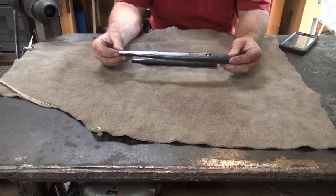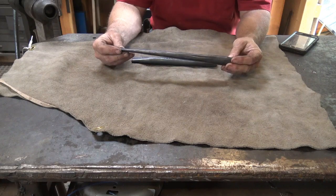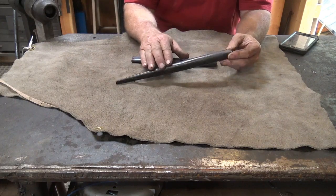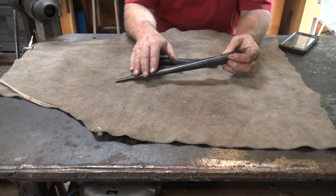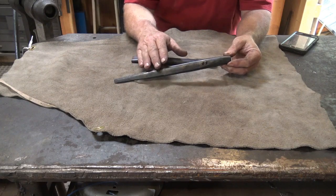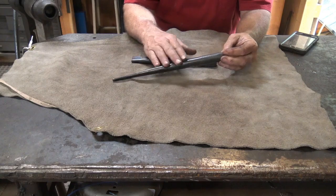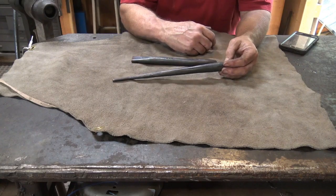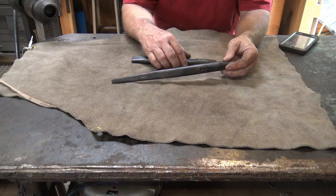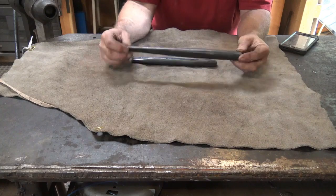We left the drift in the toaster oven at 450°F for an hour, then let it cool. The drift is made out of an old piece of jackhammer bit — it's roughly the equivalent of S2 steel. It seems like it gets relatively hard in oil, and harder in water if it's going to be a cutting tool, but it's never going to be real hard and hold a real good edge. But it's a good tool for drifts. In use, this is going to get a dull red at times, so it doesn't really have to be hardened and tempered — but I do it anyways.